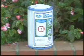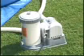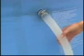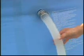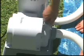For larger pumps which use the B-size cartridges, close the pool valves and open the air relief valve on the filter tower. For models 633 and 635, open the lower valve first and then the upper valve. You may have to shake the intake hose up and down to allow air to move out through the valve. Model 633 also has an air relief valve over the connection on the motor housing, which can be opened to allow air out.